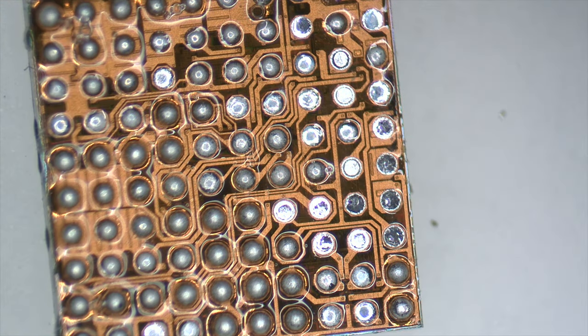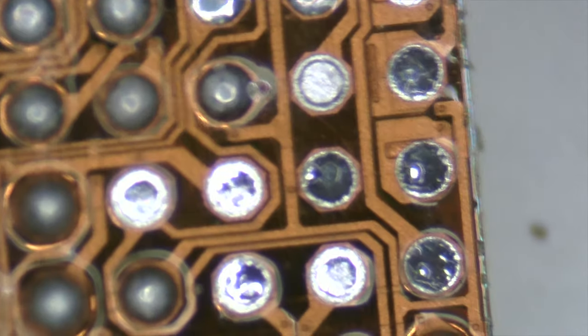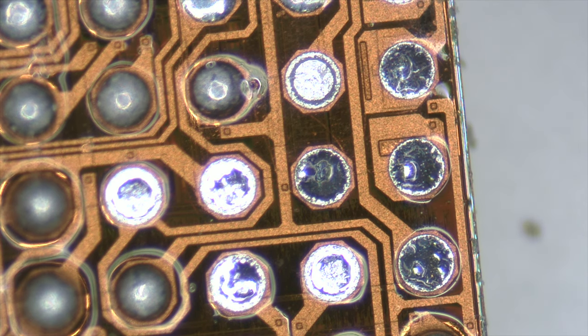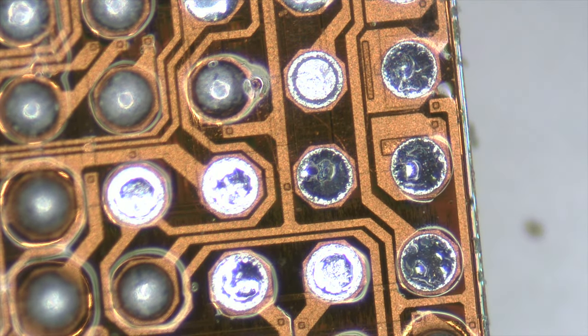This is the old IF PMIC or charging IC. In this area you can see the black pads. Unfortunately, over time some specific area has been damaged, which has prevented the IC from sending charging current to the battery. This is due to the fact that the pads have been heated excessively. In all charging and voltage management circuits, you can find these failures. You can easily earn a good salary by repairing these phones.